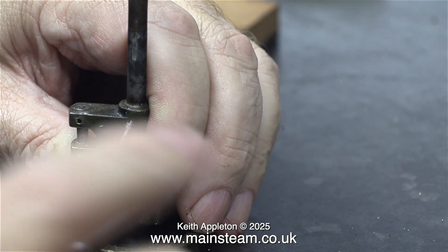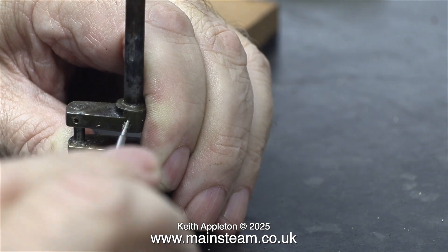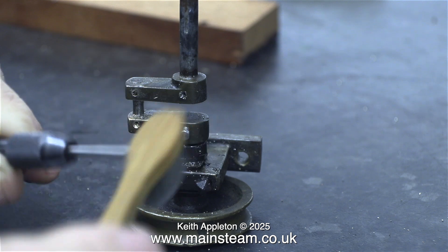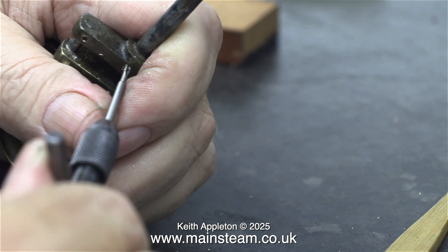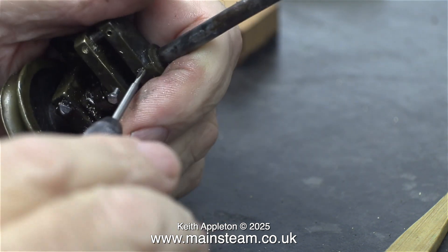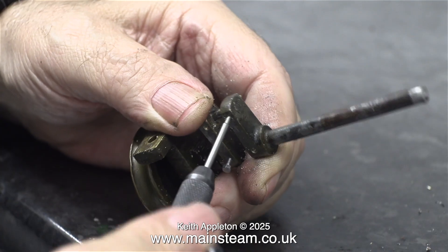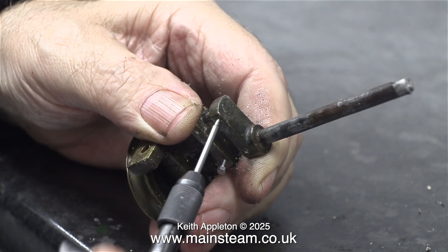I'm also using plenty of lubricant — the lubricant of choice is my Halit Oils Bearing Oil. Here you can see what the plan is: once I've drilled the holes, I'm going to put bolts in the holes. Here I'm cleaning the tap using a toothbrush, as I mentioned. It's one turn in and one turn out — it's really important to keep the chips at an absolute minimum. This tap will break very easily, although it is a high speed steel tap, which is always a good idea.